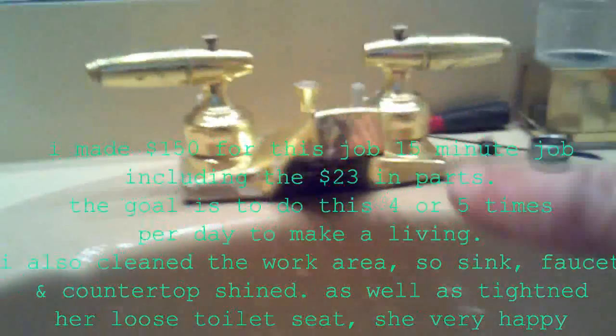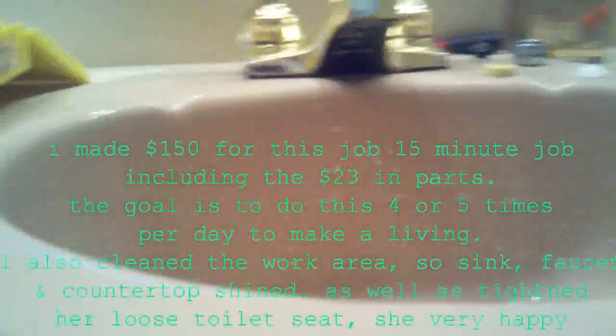Okay, and try to hide. Well, yeah, see, there it is. That would be all debris that would clog the screen inside your aerator. So that's why you take the aerator off, because of that debris that comes out of the pipe. So we want to flush this and manipulate it and flush it out. And it's not leaking, so that part's good.